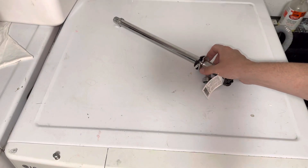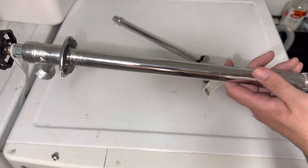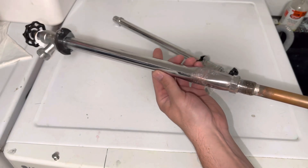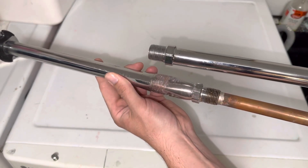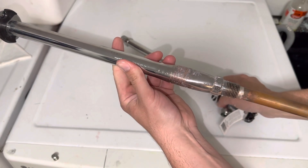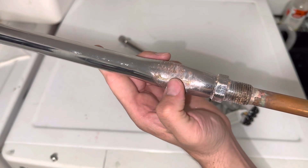And to show you why it is extremely important, here we have the old faucet that we just took off from our basement. And if you look right here, it's the exact same model. There's the ends of it — you can see the comparison, how much it's swollen. So it actually froze up and swelled, and right there is a nice healthy split.